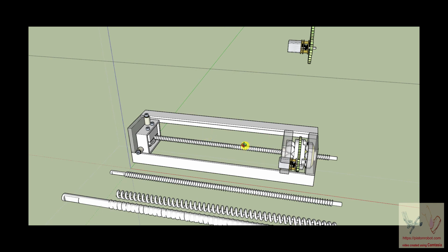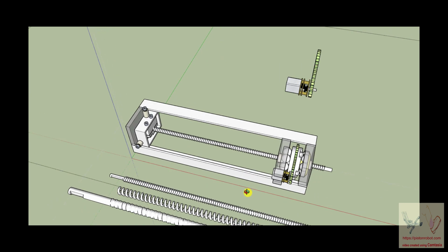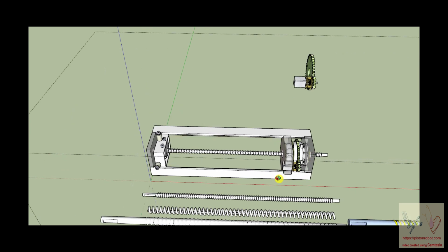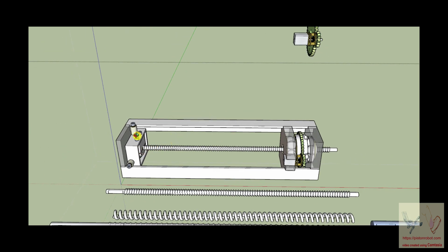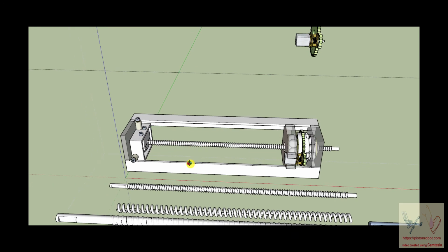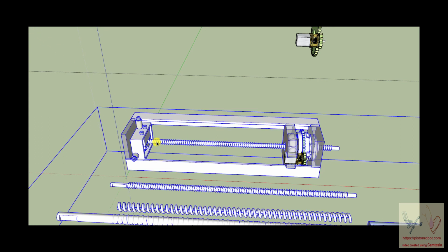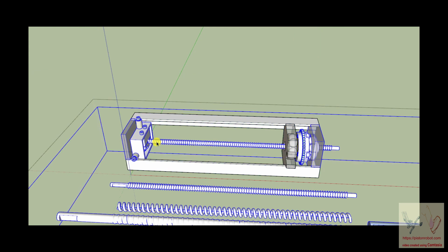And we're back. Hello. It's all so clear to me, and I keep forgetting little parts. So, okay, the inability of this to rotate means that the ball shaft does not rotate. So that allows this to do one of the things that a hydraulic cylinder will do, which is that it pushes its rod out or it pulls its rod back. But there is another feature that we need to discuss, and it's going to take me a minute to see if I remember how I lined this thing up.